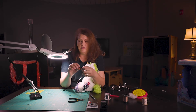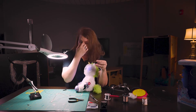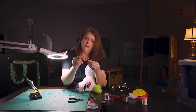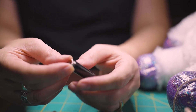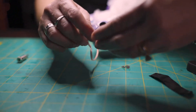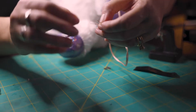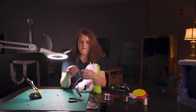This is one of the final steps. You're going to take that end and take your inline jack — this one is a 1/8 inch mono inline phone jack, and we'll give you the links on where you can purchase these. The top part, the silver, actually unscrews from the black casing part. This is an important part that everybody forgets — make sure you take your black casing part, take your two wires, and lace them through the unthreaded area and pull that straight up so it'll be there when you're ready to finalize everything.